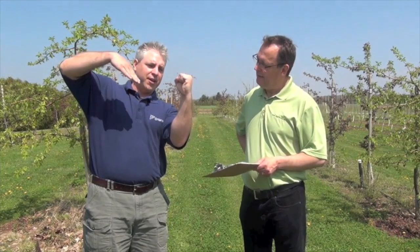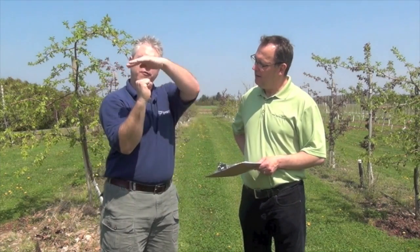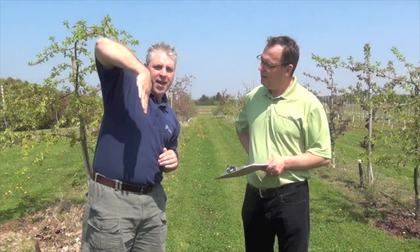And speaking of angles, you're looking for angled spray, right? Definitely. Picture a vertical target — you've got the direction of travel and a fan coming at that target. It sort of paints up one side, and then as the sprayer passes over, it paints down the far side. If you're going too fast, it'll flatten out that front fan, and the back fan will trail straight, and you've sort of defeated the whole reason for having it to begin with.